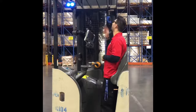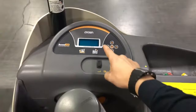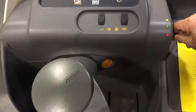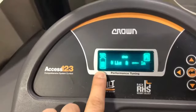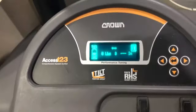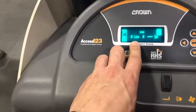Once we've actually mounted this piece of equipment, you may recognize your dashboard just like the rest of the Crown equipment in this facility. You have these arrows and your screen. Down to the right, you have your on/off switch, which is like a little key ignition. Turn your ignition switch to the green dot and hold it for about a second — you're going to hear a beep and notice your dashboard light up. Wait for it to power cycle as it gets its settings and readings ready. On your dash, you have your battery percentage giving you an exact reading of where your battery is. Never let it go too low — always have this equipment charged out before it gets stranded somewhere in the facility. You also have your poundage display, which tells you the exact weight you have on your forks, which is pretty neat.